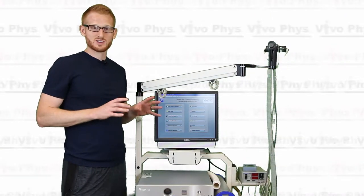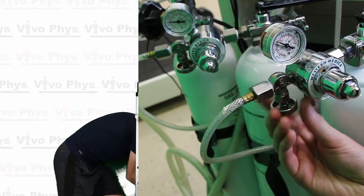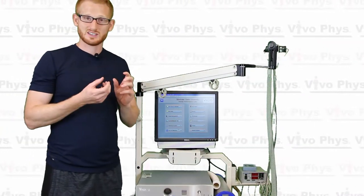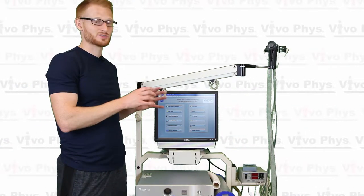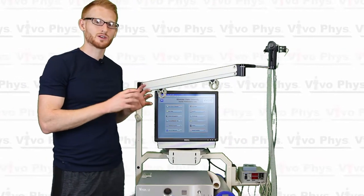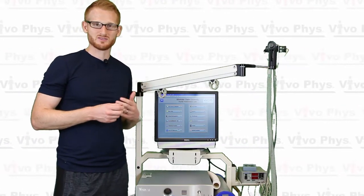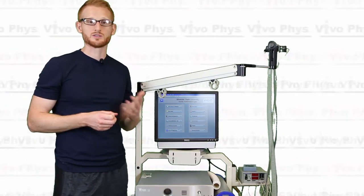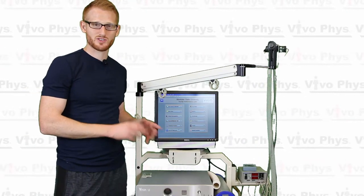Before you do anything else, make sure that you go back and turn those gas tanks off. When you turn those gas tanks off, finger tight — very light finger tight — you don't want to really crank it in there, you don't want to strip those screws. It's very critical that you turn those off because those tanks will continually pump out little bits of air at a time, and after a few days of being on unnecessarily, they will begin to run low or completely run out of gas. When that happens, you're not going to be able to calibrate the system without buying new tanks, and those tanks are pretty expensive. So make sure that you always turn those tanks off.